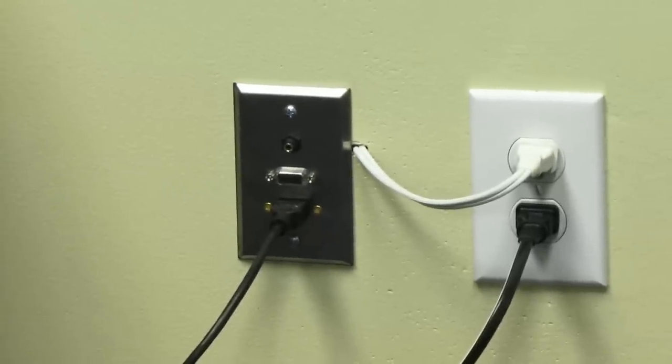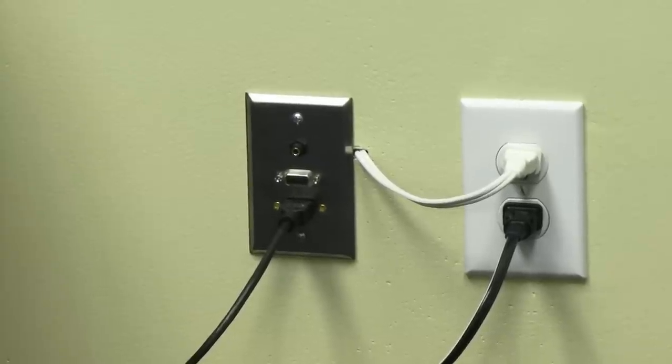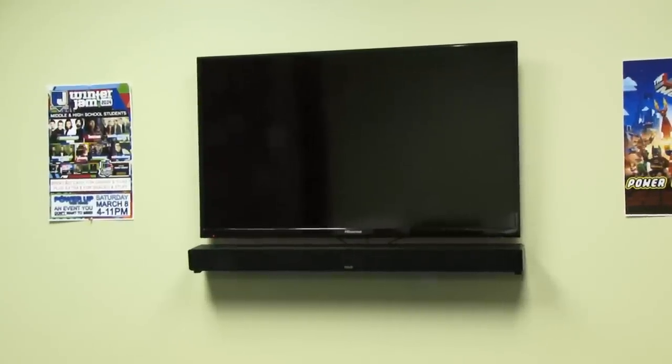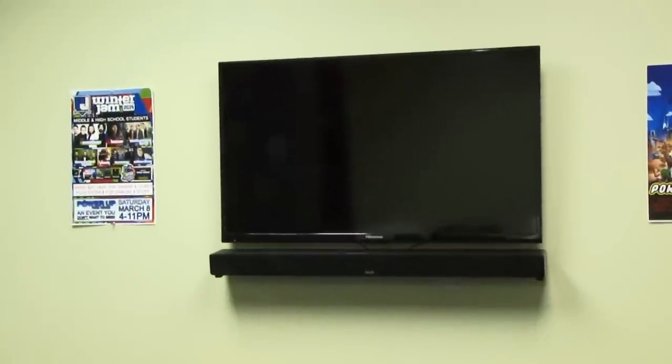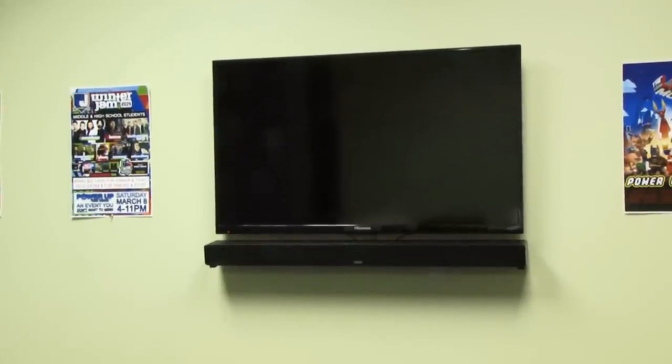This white cord going up into the plug — I'm going to make an outlet up on top eventually, but for now I'm using an extension cord behind the TV that the TV power and the speaker below are both plugged into. It runs down at the bottom, which looks a bit rough, so I'll fix that with an outlet up top. But there you have it — an easy DIY flat-screen TV wall mount for less than $20. I actually got two TVs mounted for less than $20, because it was $15 for the Unistrut and a couple bucks for the screws and bolts. Hopefully it's helpful to you — if you liked this video, please like, comment, and subscribe. Thanks for watching!